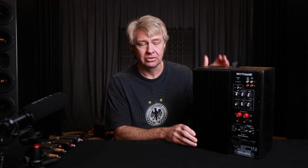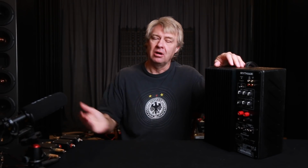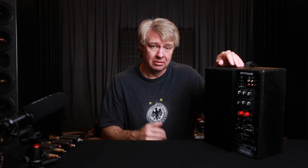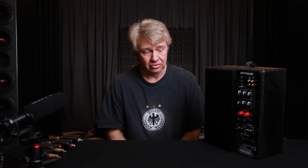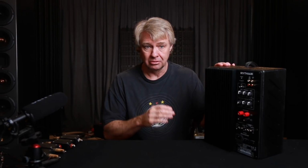First of all, servo control system. This is not the servo control systems of old. I've had people ask me or say to me, "Oh, Paul over there at PS Audio says they're not even using servo subs anymore. They're back to regular woofers, but they think that's better." And that may be better for them. But this is not that type of servo system. They're talking about old accelerometer-based servo subs from the 1970s. This is a whole different technology. It's using a sensing coil that is much more accurate, much faster, and has a lot better control, and literally will do anything you want it to do. I mean, you can change the damping settings, the Q of the whole system on the fly with this thing.